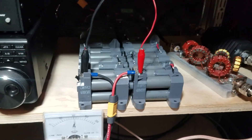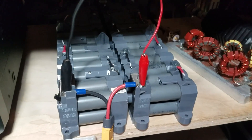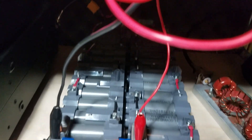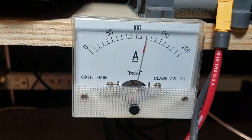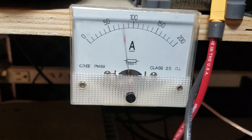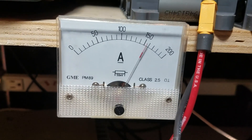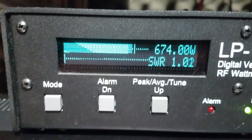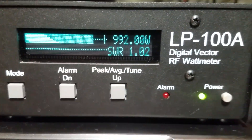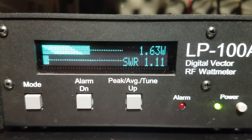This is the buffer battery right here — 55 volts, charged to about 80%, which is 3.9 volts per cell. It feeds the LDMOS amplifier. This is a 20-amp full-scale ammeter, so you can watch the current on transmit.